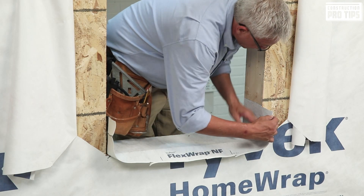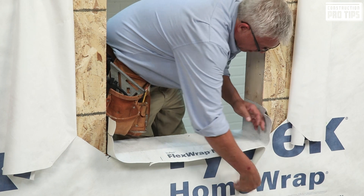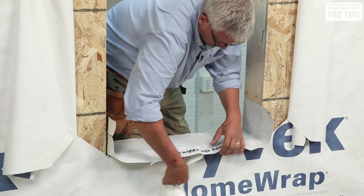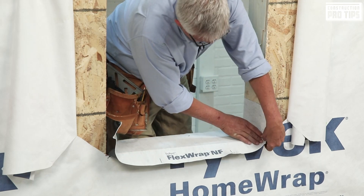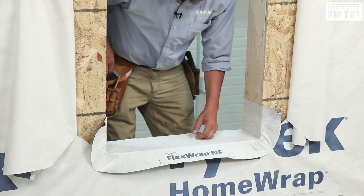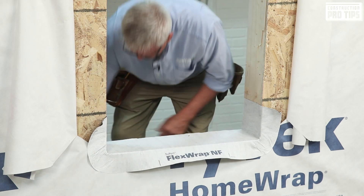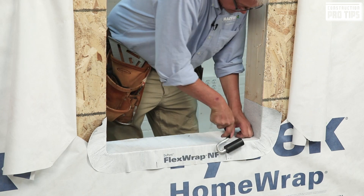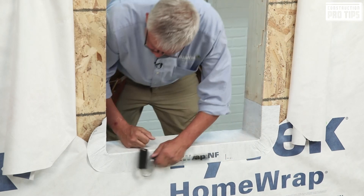At the corners, I'm looking at how things are laid out. I'm going to grab the back of that release, pull it out and forward. I've pulled off the release paper, and now I'm going to take and rub that down in the front, push my fingers into the corner and press it out. Use my speed square to get that pushed out there. Then grab my roller and roll that product down the center, and with your fingers, mold up against the edge and rub that product down. This is pressure sensitive — you need to apply pressure.